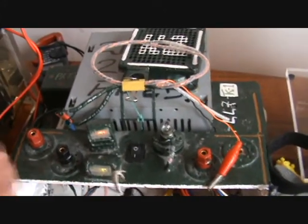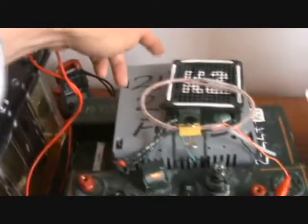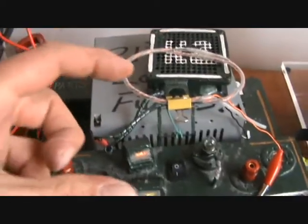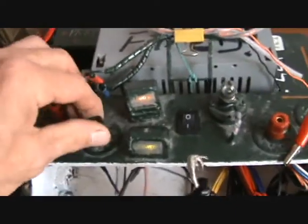You know, your card plate in there — whip that out and you can put it in the car. Just discard the 240 volt converter in here, discard the card, and just keep the computer card with the 12 volt in it and you'll get all these outputs out of it. Normally I tuck these away to one side and just use the 12 volts — just hook them straight up. I've discarded all the other bits and pieces, it works fine for me. Anyway guys, that's what I figure is going on there.